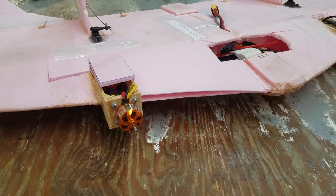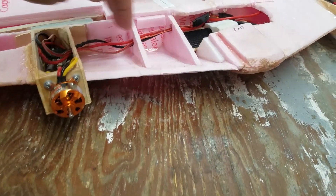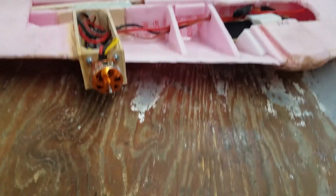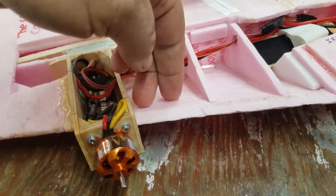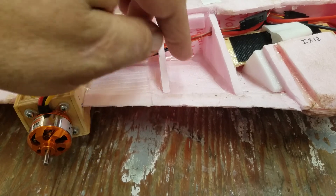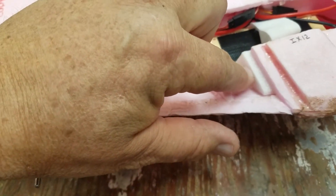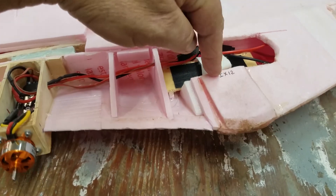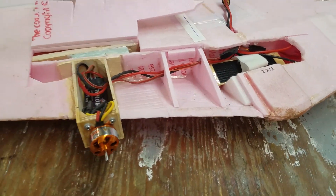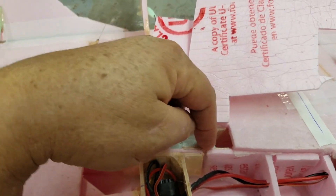When I crashed, this nacelle got blown out — it was crushed, just busted out of there. The leading edge and everything in here was destroyed. I've had to replace this. I added riblets; this was all cracked up and has been repaired. I added a piece to keep the nose from sinking in, and I put a splice on the spar — the spar was broken.